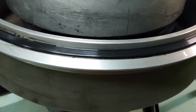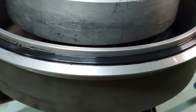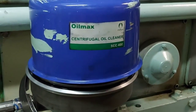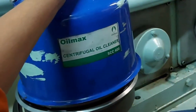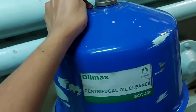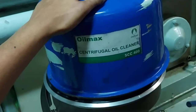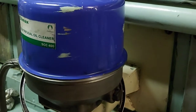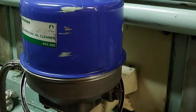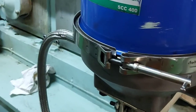If you want to renew the cover o-ring, you can do so now. Put the centrifuge filter cover on the shaft and tighten the wing nut first — the wing nut is on the top. Then fit the clamp and tighten it. This is how the centrifuge filter servicing is done.